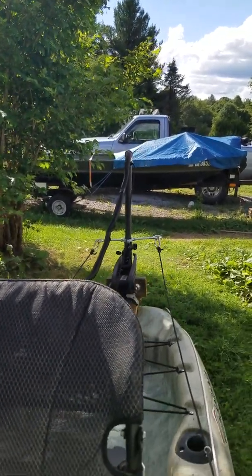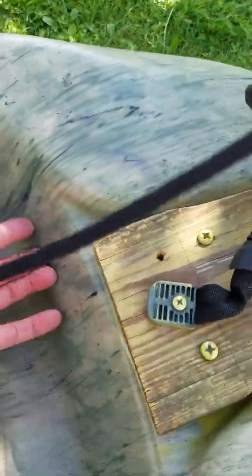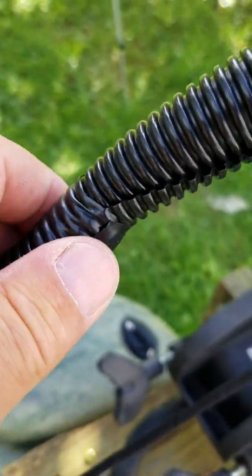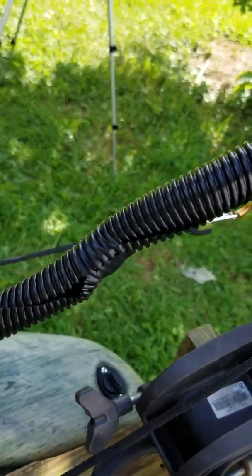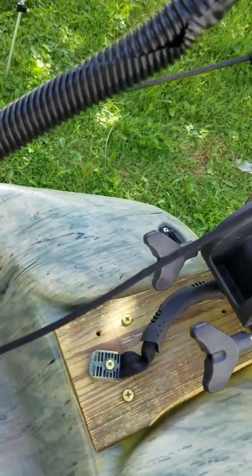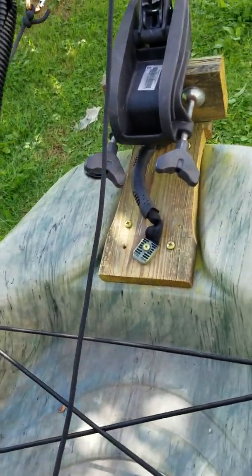That's basically all there is to it. Now eventually I'm going to put me a 4-prong trailer plug in this area here somewhere, because there's 4 leads in this. There's a ground for your motor, and then there's 2 like 14 gauge control leads. So you need a 4-prong connector, pardon me, a 7-prong trailer connector will work. They're watertight and everything, just use 4 prongs.